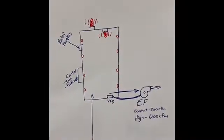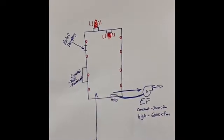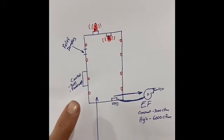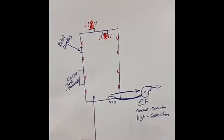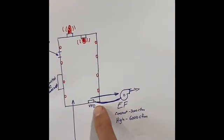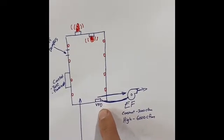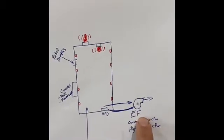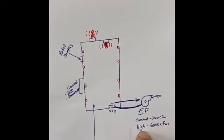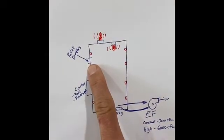I'm going to give you a quick overview of the system we're going to talk about today. We have a space with ethanol in it and eight sensors around there. There's makeup air coming in at a constant volume, with a matched exhaust fan tied in with the hand-off-auto switch on the VFD. When you turn that on, it turns both on. If there's an alarm in the space, it'll kick the fan up to high speed and pull in extra air through the relief dampers.